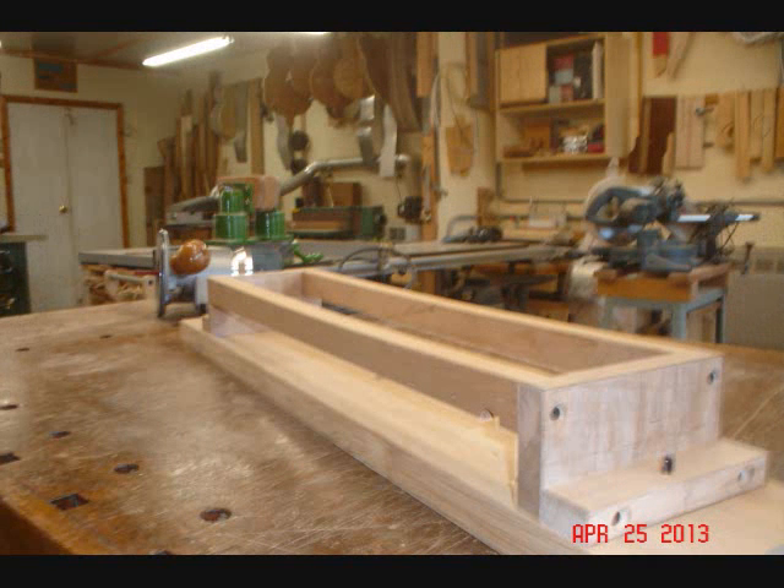My next step was to build this frame. This is a track on top of which a router is going to glide either back and forth, or it will be moved maybe a half to three-eighths of an inch at a time. This is going to support the router over the rotating disc. The rails on top of it are made specifically at that 40-foot radius. You don't see them well in this picture, but you do see at the foreground that it's pinned — it's actually registered on that staging board to hold it in perfect alignment with the center line so that everything is just where we want it to be and it stays there.